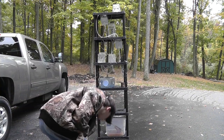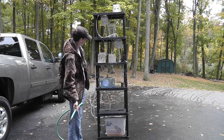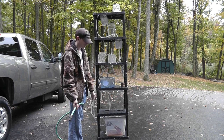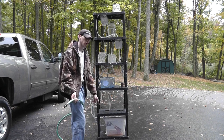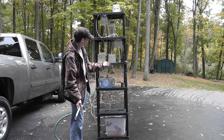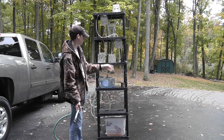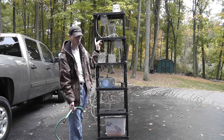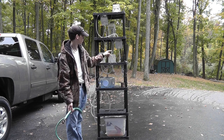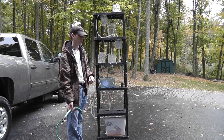So now, this right here would have a continuous feed of water going in. This would be the high water marker, and somewhere down the hill, this would be a low water marker on the ground. So you would have the fall from here to here, and it would bring it up to here, or actually higher. Since you have check valves on it, it can go way higher, probably 15-20 feet in the air from this point upward. It can go about 20 feet, according to some of the newspaper articles.